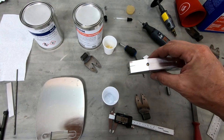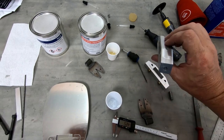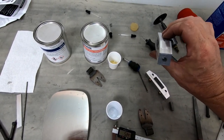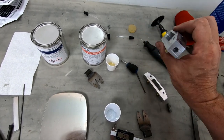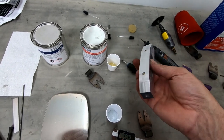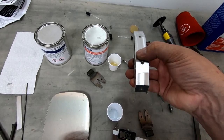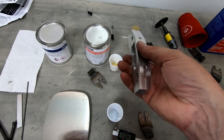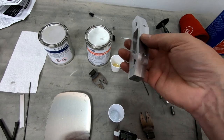Now, because my gear is completely flat across the top, these will sit basically perpendicular to the ground and won't be at the angle that they show in the plans, because I'm not mounting this on the curved part of the bow of the fiberglass gear. So it's gonna be interesting to see how these fit. I don't know how far up I can get these as close to the fuselage as possible, or if I'm gonna hit these corners here, which I probably will. It's part of the reason I think there's a bevel on these, is that they're supposed to be tilted and then they can be moved up a little bit higher.